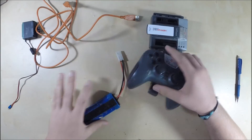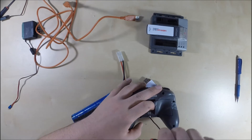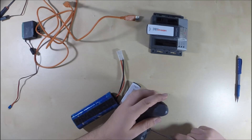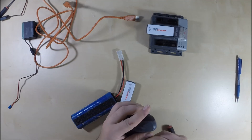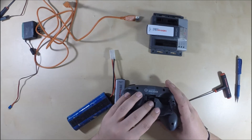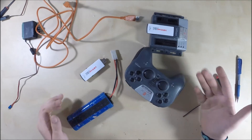For batteries on the joystick, you need to remove the VEXnet key and undo the screw — use a 5/64 Allen wrench, put it in, and unscrew it. That opens up the battery compartment, which takes six AAA batteries. We use blue VEX rechargeable batteries, and we'll show the charging station in a later video. Replace those batteries, screw the cover back in, and put your VEXnet key back in. And that's the logical brain — I'll see you next time.